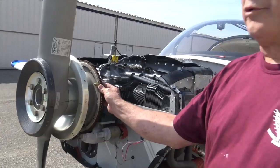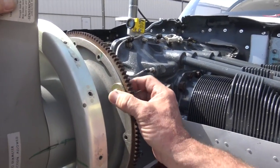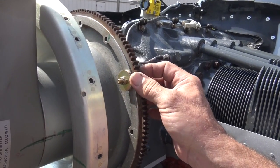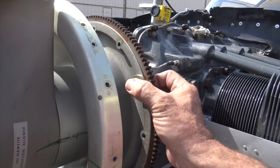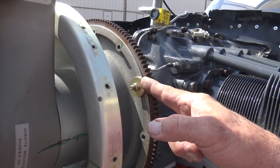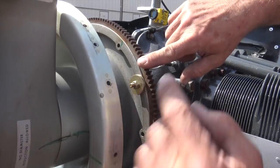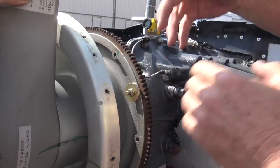So we were trying to get close to 32 grams, and we had 32 grams exactly, but the bolt was going to be too long, so we'd have to add a washer to get locking, which would change the weight. So we went to a shorter bolt, we added another big washer. Now, this combination of the bolt, the nut, and the three washers, the AN970-4s, is actually 33 grams, but then again, we're not actually at 6 inches from center. We're about 5 1/4. So we went a little heavy.